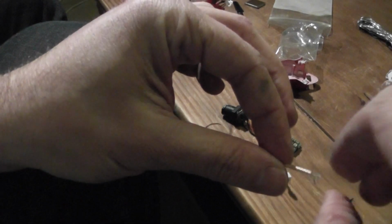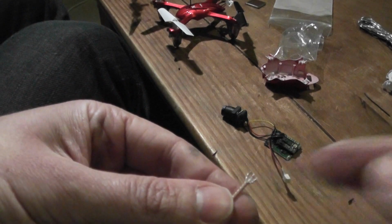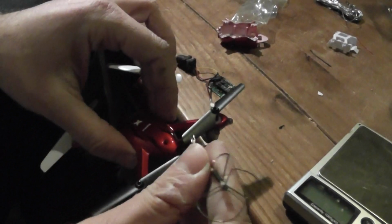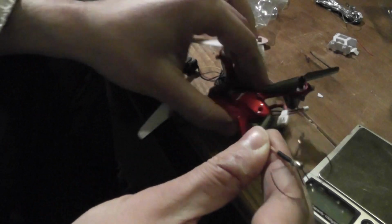It's done. I've got the internal connector prepared like this, and I will use some flux to pre-install everything, and it will be ready to solder in this part here. Okay, so I will make a kind of fork, something like this, and prepare for the soldering job. I will use a soldering iron to pre-install everything. So now I solder, and I will insert it in the hole because I have no choice. Now you have to close everything, to join everything.